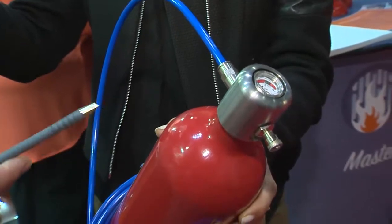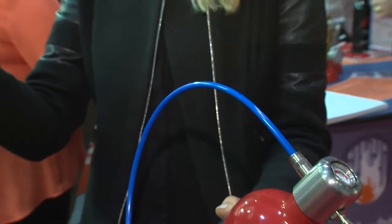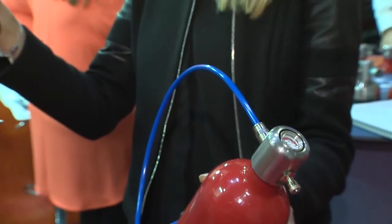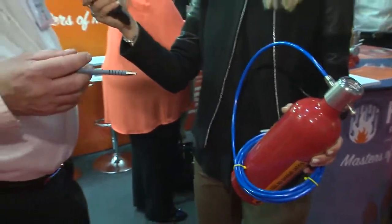In the case of a fire, the tube will form a single small blister. It won't split and do anything else. And the contents of the cylinder are discharged out of that small hole in the tube directly at the fire. And once again, I say there are no moving parts to it, and there are no electrical connections. And that means that you've got a very simple bit of kit that detects the fire and suppresses it literally within a few seconds. And it's a pneumatic bit of kit. It's not electrically initiated. There is no human intervention required at all.